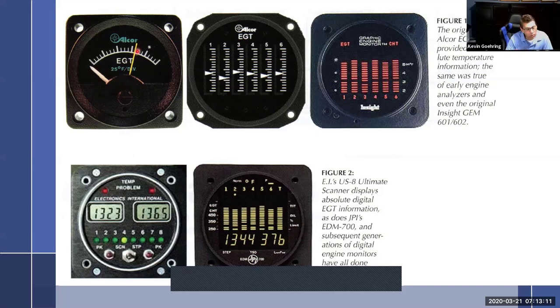And so I would know where my peak EGT is. And so if I wanted to run 100 degrees rich of peak, then I would pull this out until I got peak, and then keep pulling it until I got, rich of peak would be, I would pull it out and pull it out until it was 100 degrees away. So that'd be 25, 50, 75.